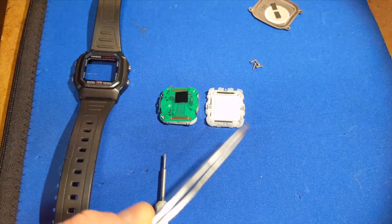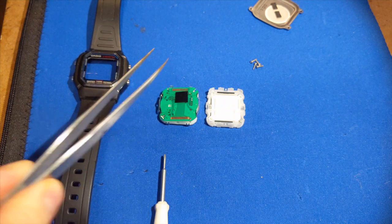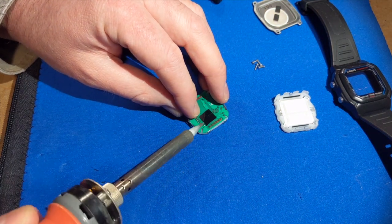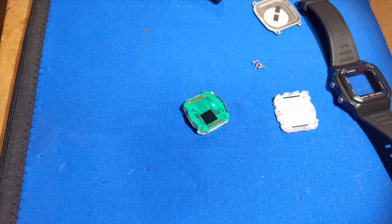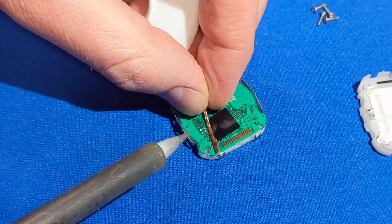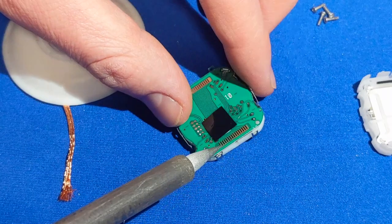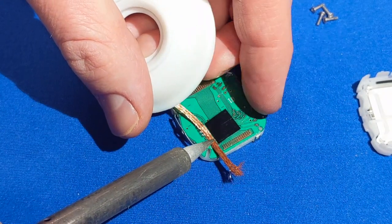Alright, I'm going to fire up the soldering iron and try and get this thing on the road and remove that jumper. What we're going to do is run this soldering iron over the pad just to get it a little molten. Then I'm going to take my copper braid, set it down on the pad, and scoop away all that nice solder until it's nice and clean.